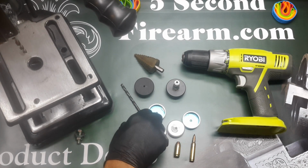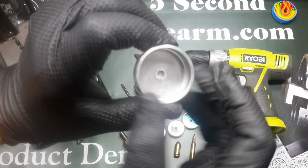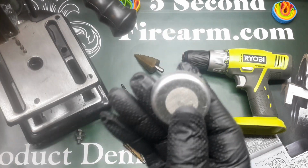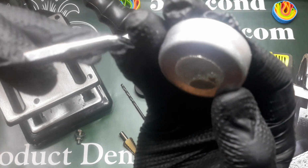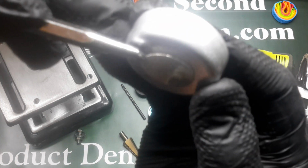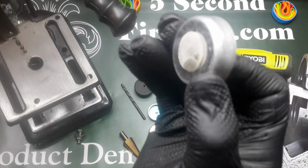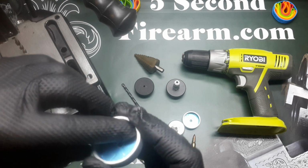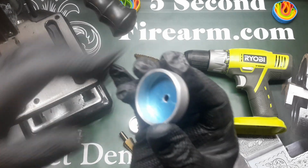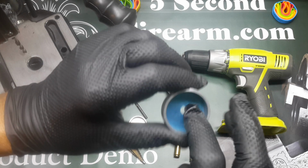So let's take a look at some of the cups. What you'll see is that these are 2 millimeter thick cups, which is pretty substantial for some materials. Aluminum, it's pretty standard. What you'll need to do is use a blade and cut through the glue spot to remove the screen. The screens themselves are adjustable, so you can adjust that for any type of solvent flow so that your debris doesn't all pile up in here and stop the filtration of your other units going through. What I've got here is not really a blue cup. This is the protection that was on the plated aluminum before a 30-ton punch pressed this shape in this hole. And that's why we have these done professionally.